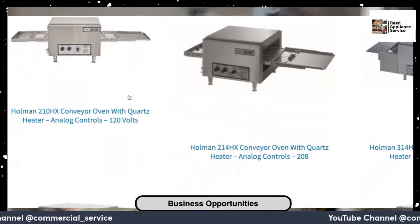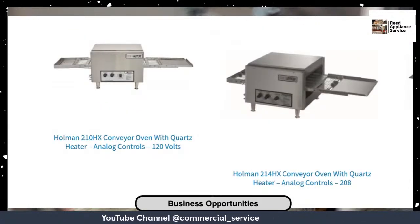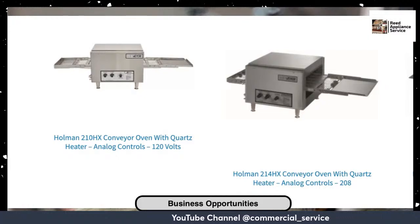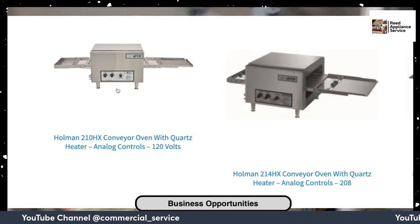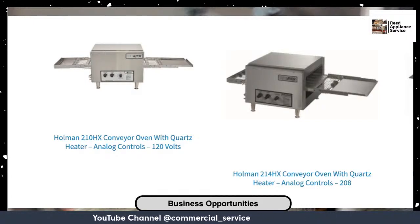the crumbs will have a tendency of catching fire, getting hot, things like that, and it'll cause the thermostat to register the wrong temperature, and so they'll try to adjust it up, and then it just causes a whole lot of issues. So you'll find broken knobs with thermostat controls. There's a fan underneath. That fan needs to be clean. It collects, because of the steamers around, it will collect all kind of lint and block up the cooling fan